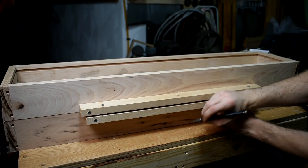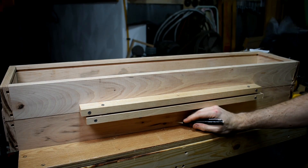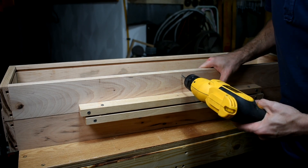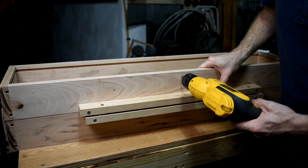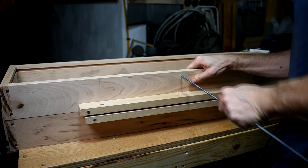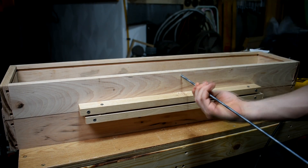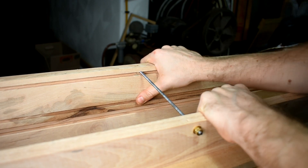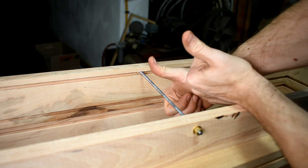There's still some bowing that's just bound to happen — there's a lot of force going in here. Blackbeard uses a clamp while ramming it up, but I'm too lazy for that, so I'm going to drill some holes near the top of the top and the bottom of the bottom, away from the center parting line — about half an inch to three-quarters of an inch down from the very top. I'm going to run a threaded rod through that hole and stick nuts on either side. This will completely prevent it from bowing out, and it's small enough that you can ram sand around it.